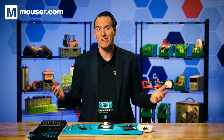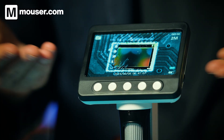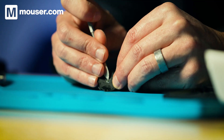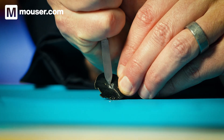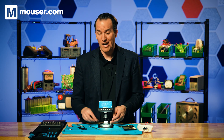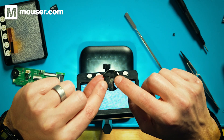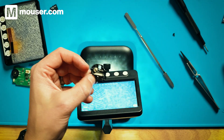But this type of sensor is essentially at the heart of every digital camera system out there, including the ones you're watching through right now — your webcam and microscopes. Let's see if we can get the sensor off the board. Normally you'd want a heat gun or something fancier, but we're just going to scrape it and see what happens. We can see this was a BGA-mounted connector — another piece of evidence saying this board was fabricated differently than the main board. BGA processes are a whole other specialty process. And we can also see the sensor was mounted directly opposite to the connector, which means we can minimize the trace length from the sensor into the board itself.